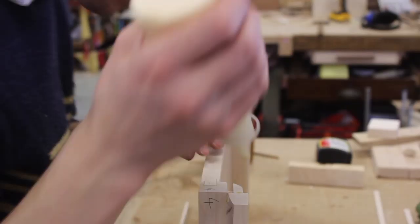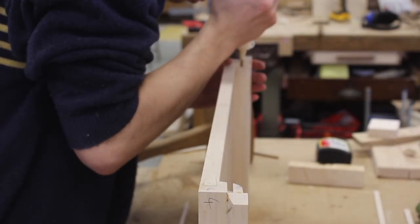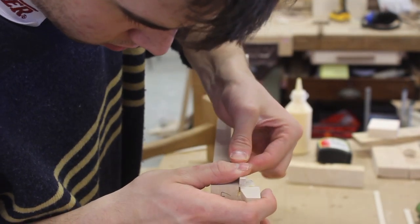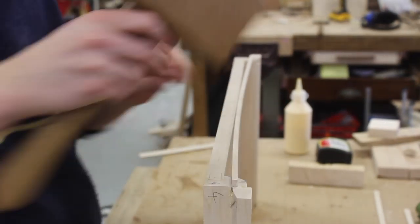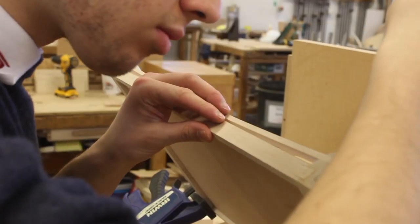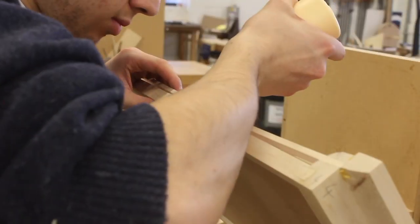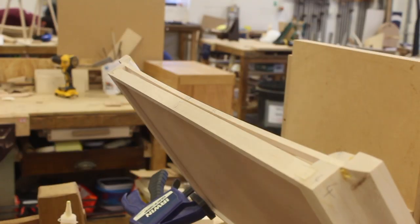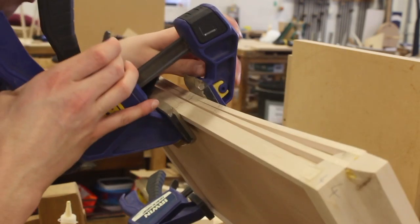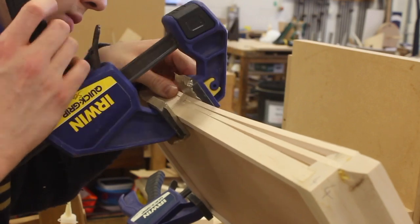The first rail is a housing joint, and the one on top is actually just sitting into a pocket. It's not actually housed all the way around, so it's the glue just holding it in. Glue, if it's a nice join and it's flat surfaces, is stronger than the wood, so I'm not worried about this tray coming apart. And as you can see there, I put a clamp in the middle to squeeze all